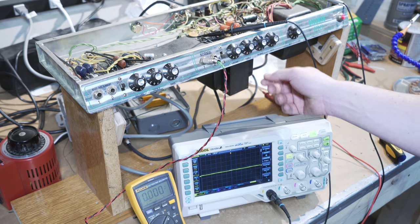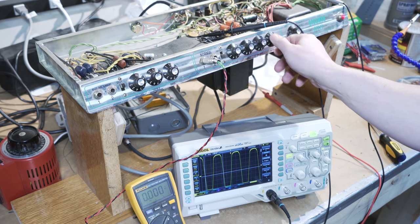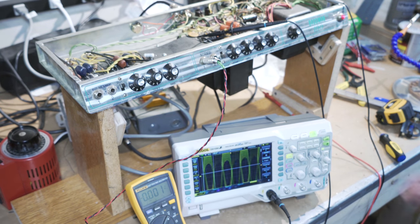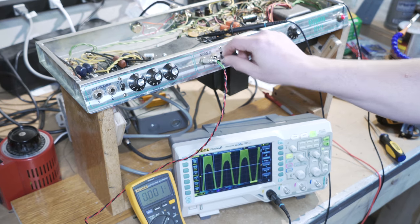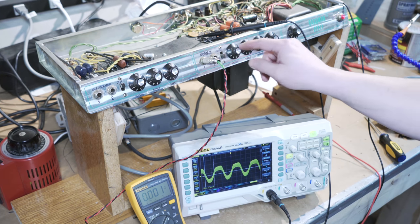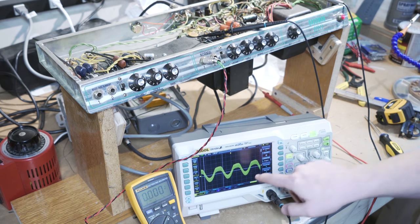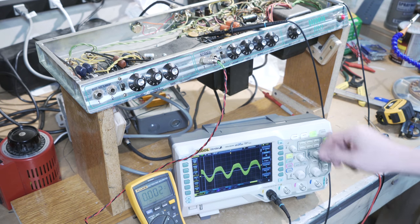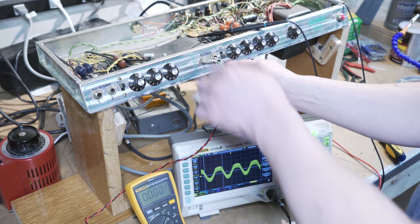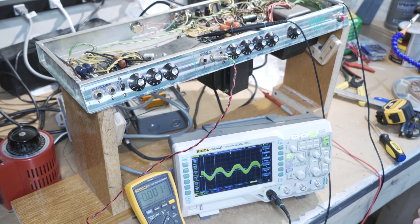And when you look at that, the normal channel has no... Oh, sorry, I forgot. If you have treble, mid, and bass turned down, let's turn those up. That will also alter the tone quite a bit. So, interestingly enough, if I'm pegging that normal channel... Oh, look, you can see there's actually a significant amount of some kind of ugly noise carrying across the top of the signal. So this may be what this channel has been talking about, sounding kind of crummy. There's definitely something amiss with that channel.